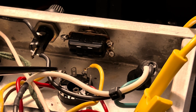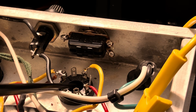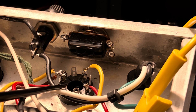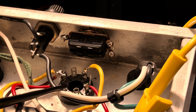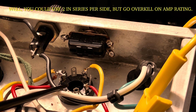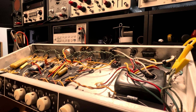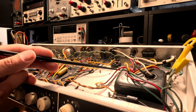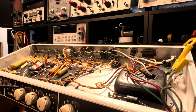Thanks for removing the death cap. Another thing that makes this unreliable for stage or studio use: there's no safety mechanism on this rectifier tube socket. Since this unloaded will be about 500 volts, your 1N4007 diode is not going to cut it - you're going to want to use 1N5408s, and I use a string of them on each side of this rectifier tube. I'll use this lug to house a terminal strip - not for a ground, but to mount those 5408s as backup rectifier diodes.